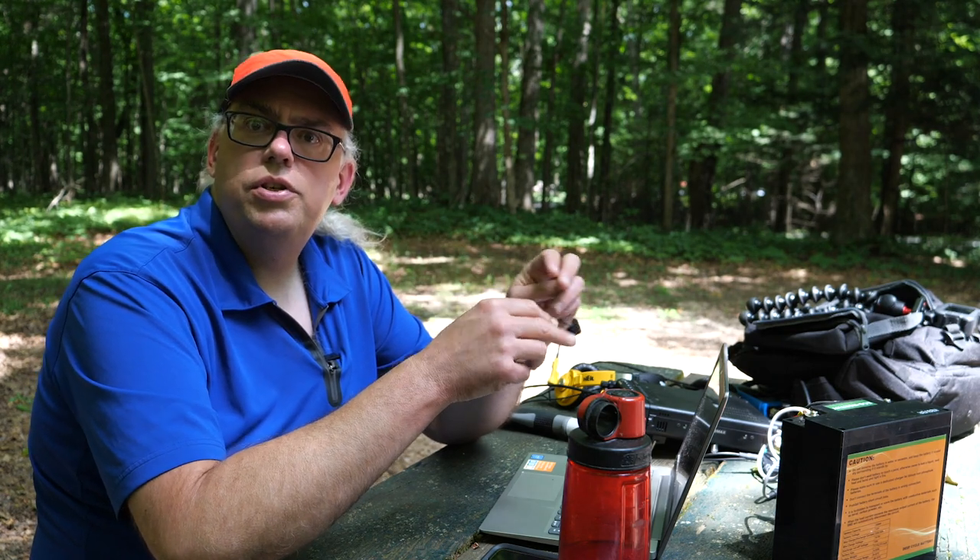This is not a do-all kind of antenna. This antenna has a very specific use case, and I think you'll find it works great in certain situations — for EMCOM, emergency communications, where you need a multiband antenna that you can quickly slip from frequency to frequency, band to band, without having to readjust. It is directional, so you can tailor its directivity. With the antenna going east-west, I had a very high propensity of north-south contacts — actually south contacts since I'm in Wisconsin. So even though you lose some efficiency, you can make up for it in its radiation pattern. It's great for modes like Winlink or ALE — automatic link establishment — where you need to go from band to band to either deliver or pick up an email message or to establish communication.